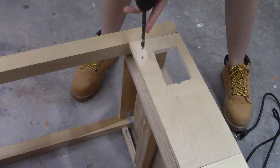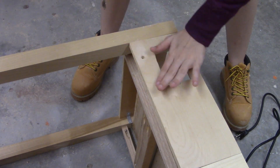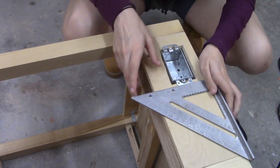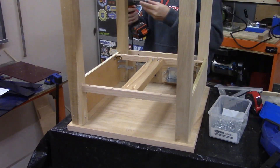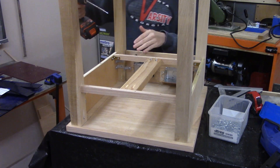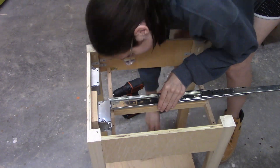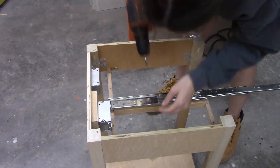I'm so excited. Now I'm drilling a hole for the power cable to the outlets so it can escape as it's supposed to. Now I'm attaching the outlet box for the outside — I'm just using half-inch screws for this. Then I repeat the process for the one that goes on the inside. Now I finally get to attach the lid to the legs. I put pocket screw holes into each of the legs before I assembled everything. But I made a crucial mistake — I had to take all of them out because I forgot to install the drawer hardware. I had left it on the drawer, so I had to take it off the drawer and then put it onto the place where it's supposed to be, and then attach everything.